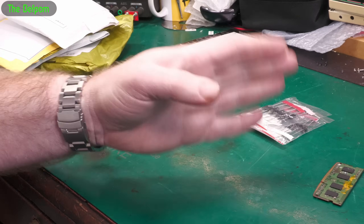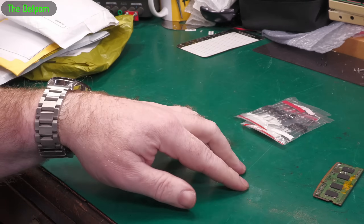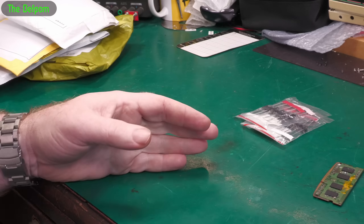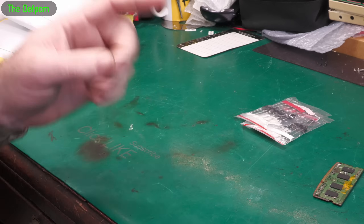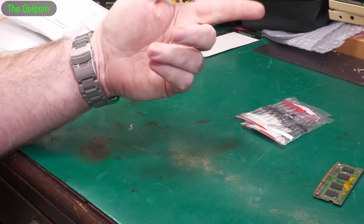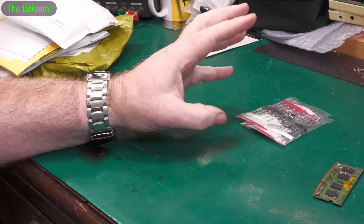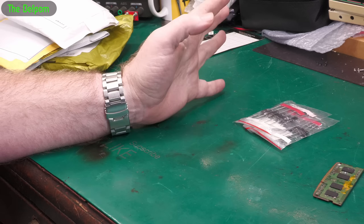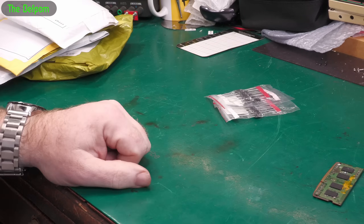Basically what's happening is in the motorhome, I've got an Ethernet setup - I've shown you some stuff on a mobile bag before. It had USB to Ethernet adapters, so you put USB in one end, ran through an Ethernet cable, USB at the other end, so you can run USB devices over an Ethernet cable. Unfortunately, what happens in the motorhome is when I'm flicking a switch on my control panel to turn devices on and off, it actually messes up the USB. I think it's because the Ethernet cable runs directly along with all these other power cables, and there's an EMF surge being emitted by the cables getting into the Ethernet cable and upsetting everything. So why don't I put some kind of suppression on it - I've put some stuff on already but it hasn't done anything, so I was going to build something instead. Anyway, that's a long-winded way of saying I've got some TVS diodes.